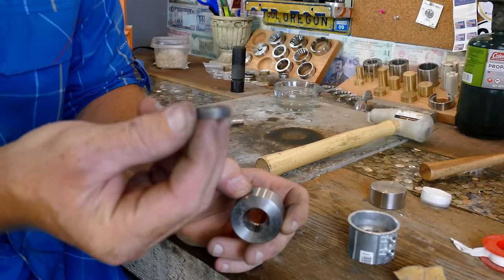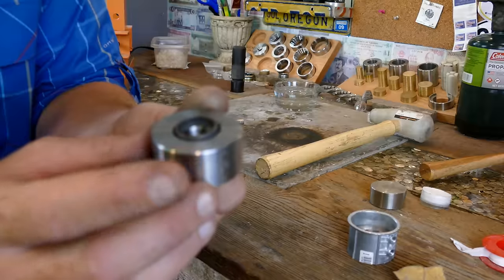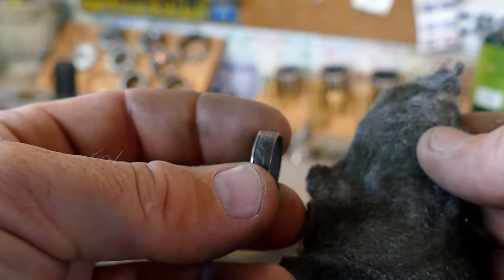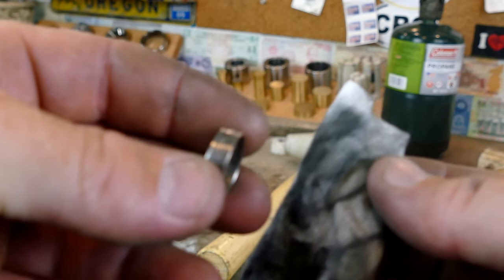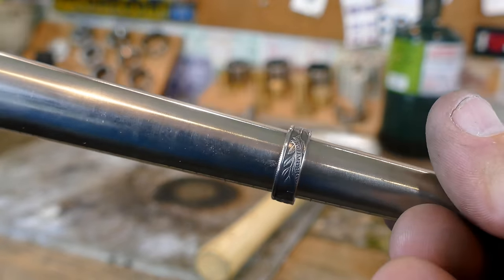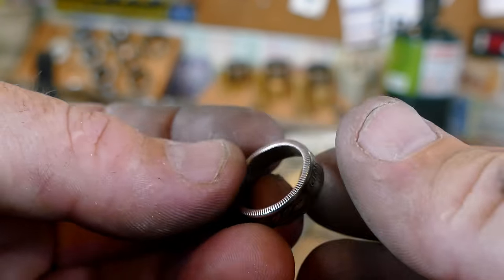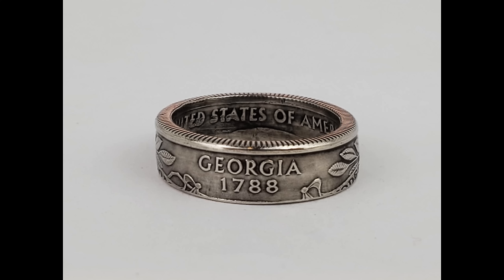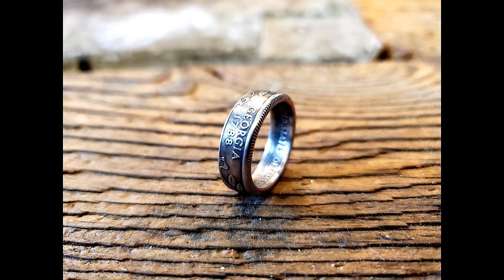A sized ring without a press, without a coin stretcher reducer — how awesome is that? Say you wanted it even smaller than a size 6 — you can go to a 0.9 by 1.0 25-degree die and reduce it down even farther in that. And now to finish this ring up, we'll just get rid of some of this oxidation with some 4-0 steel wool, and then polish it up with a disposable jewelry wipe. Now I know what you're asking — well what if I want to make it bigger? Well, that's going to have to wait for another installment — got some ideas there too without any presses. Alright guys, thanks for watching, I hope you enjoyed this video and found it useful. If you did, make sure you subscribe to my channel and check out the rings I make on my website, changeyoucanwear.net. Until next time, bye!